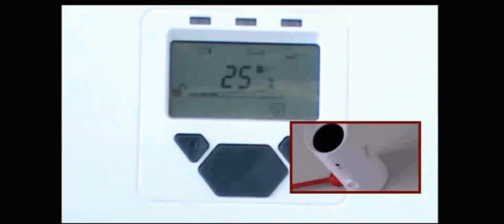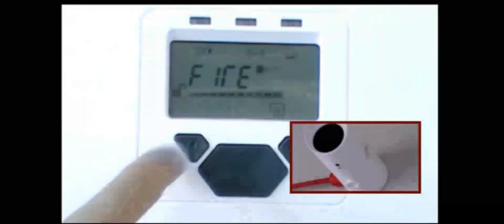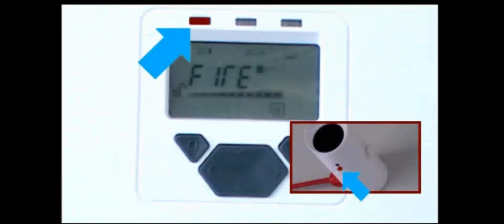Now it is time to conduct a fire and fault test to confirm correct commissioning. A remote fire test is performed by selecting the remote fire test icon, third from right. Press Tick once to test the fire LED on the underside of the receiver. A second Tick will simulate a fire condition in order to test the relay and wiring back to the fire panel. The display will show fire and the fire control panel should indicate a fire condition. The system controller LED corresponding to the receiver under test will flash red. Press the Cross button to end the test and return to normal operation.